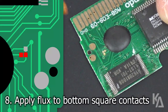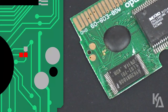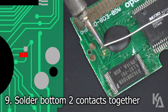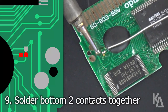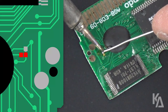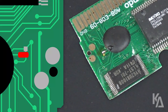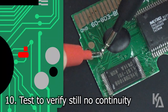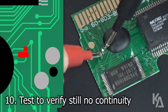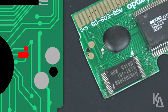After testing, use a cotton swab to apply soldering flux to the area of the bottom two squares. Once the flux is applied, use your soldering iron and some solder to bridge together the two bottom square contacts, effectively connecting them together. You want these squares to now look like the diagram on the left. With the solder in place, test the continuity between our new bridge and the top square. If you did everything correctly, there should not be any connectivity between them.